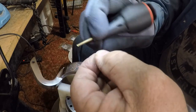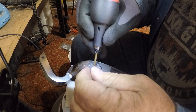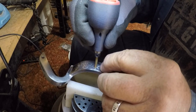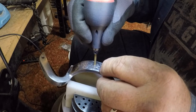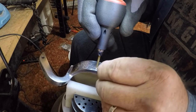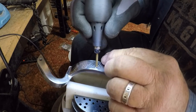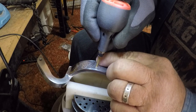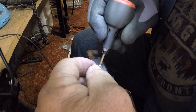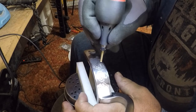Then I start the wire into that channel after I've done the undercutting. Like the outside of the heart, I just work it around slowly — it's a little more difficult on a small piece like this, but with patience you'll get it all in there. The more burrs you put in that channel, the faster it locks down. Sometimes on wire inlay you don't even have to put burrs — you can just hammer it down into the wedges — but I like to put burrs because it grabs that wire real quick, then I go ahead and finish it out.